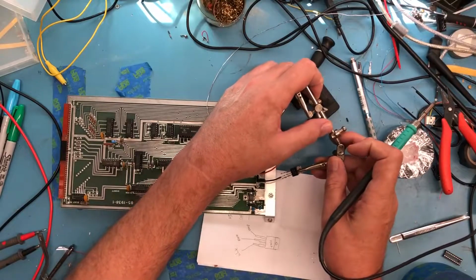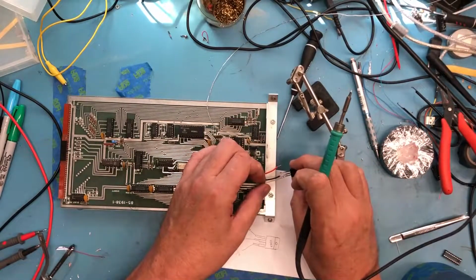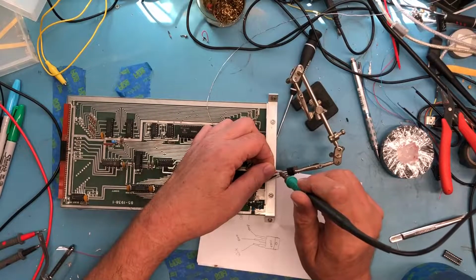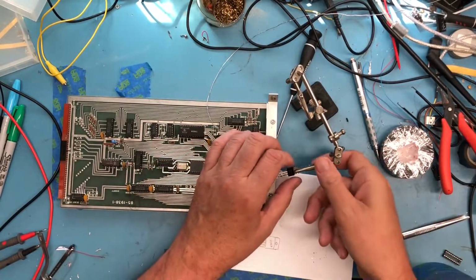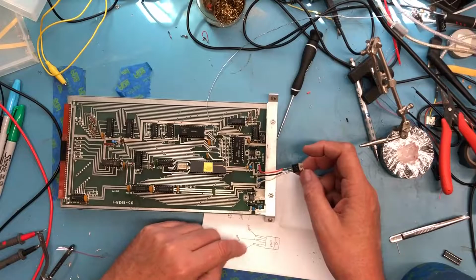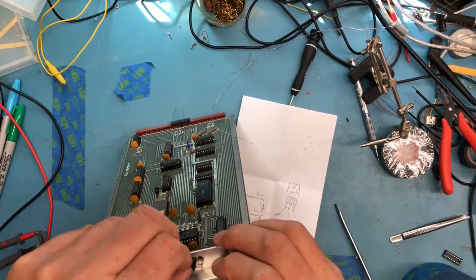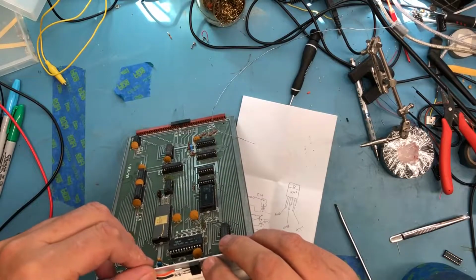The shortest here. Give myself enough length to be able to get physically on there. As you can see, things are just enough out of the way. So, face up, orange, black in the middle, white to that side. Now the question becomes, do I still have enough working length for the regulator to come back and mount without unduly stressing the leads? And I do, it's not beautiful.